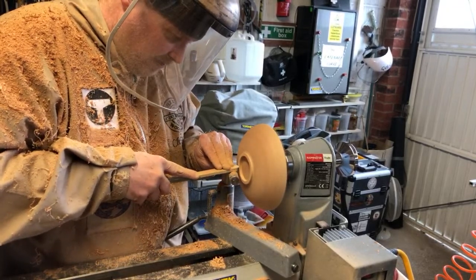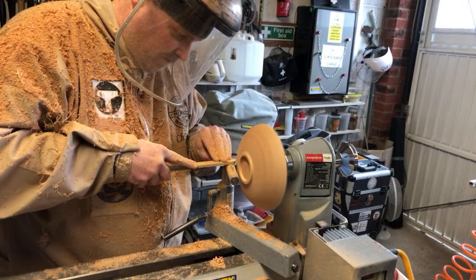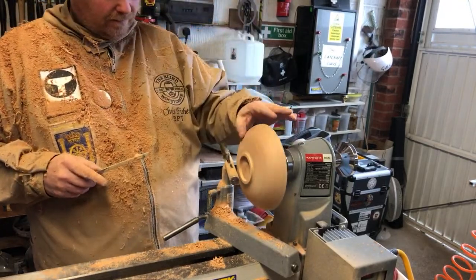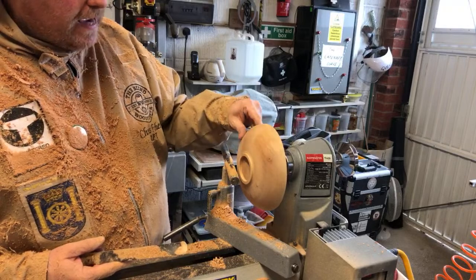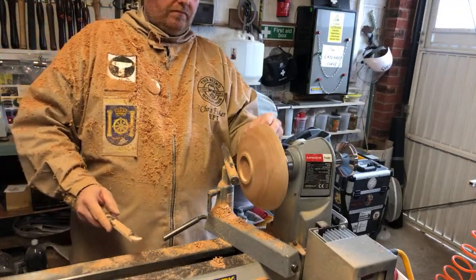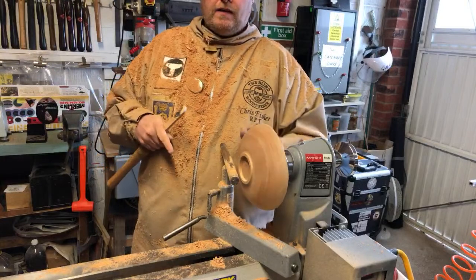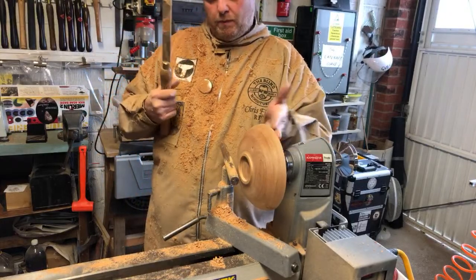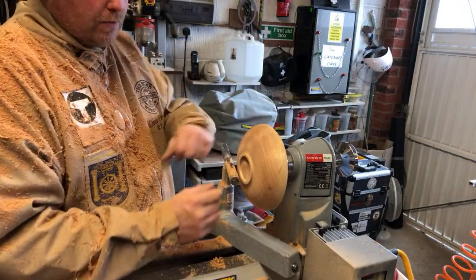This is just tidying things up a bit. Just a nice little pressure spot. Any major tear out or end grain, you'd be better off getting rid of. And the back face of this piece is also wibbly wobbly, and that's why I'm still hearing quite a bit of shudder through the bench. I can feel it's quite distorted around the back, but that's not to worry. Right, so generally, we're ready now to move on to do some power carving.